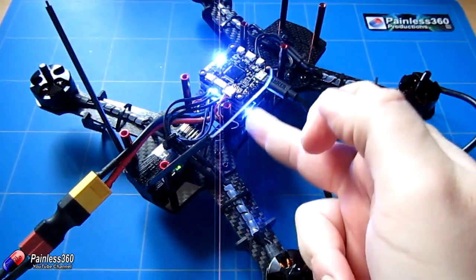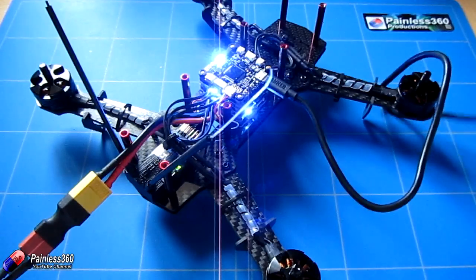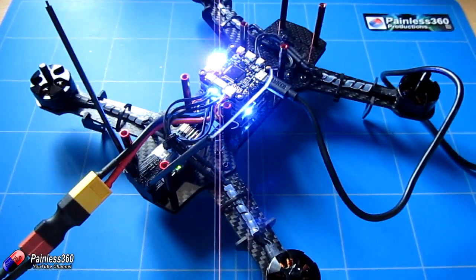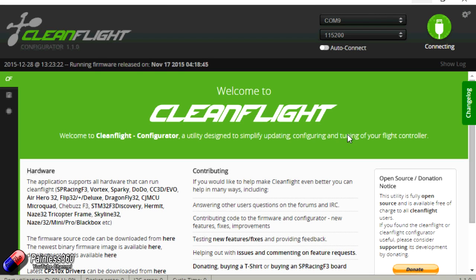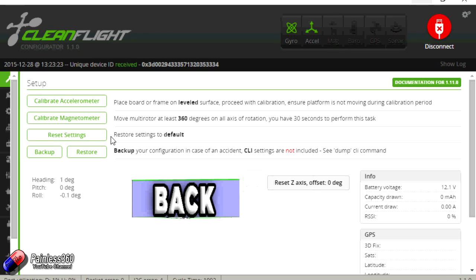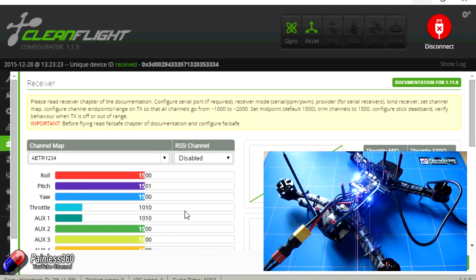We have blue lights all the way down the stack — looks very pretty and we are ready to go. Plugging it into CleanFlight, let's look at the radio settings. Moving the throttle up and down it's going from 1110 to 1990 — that should be just enough to get everything working. The aileron is working fine, the elevator goes up when the stick is at the top, the stick down reduces the channel value, and the rudder goes down to the left and up to the right.